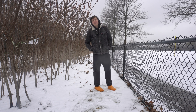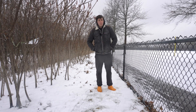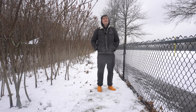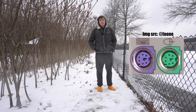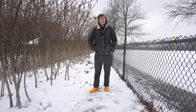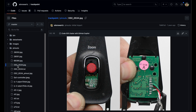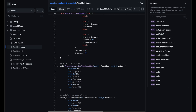My original thought was that I'm going to be embedding this in my project, so I don't want to take up a ton of space and I don't want to deal with USB — it's great for consumer products but for a small project like this it's kind of a lot of overhead. I just want nubbing up, nubbing down. At first it was looking like it would be pretty straightforward to use the trackpoint module on its own without the USB carrier board. The trackpoint modules, even the newest ones, use the PS2 protocol — not that PS2, the other PS2. That's much simpler than USB and has been around since the 80s. Some very generous GitHub users have documented all different variations of the trackpoint hardware, and there's another repo with Arduino code for driving the trackpoint directly. But unfortunately, things fell apart for me kind of quickly.